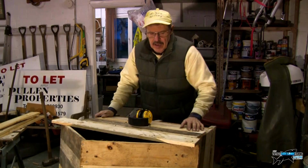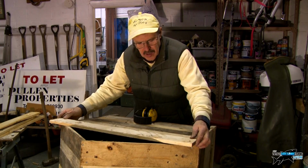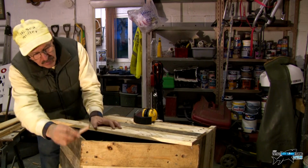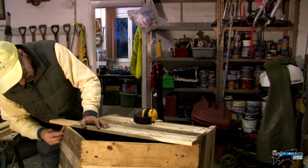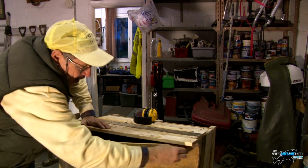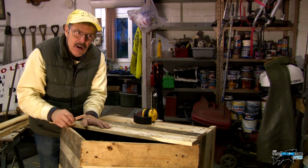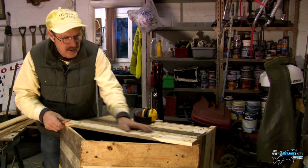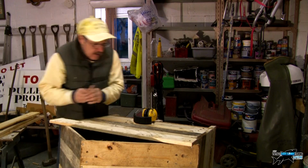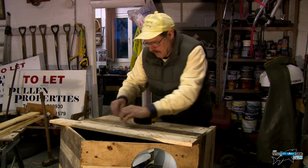Okay, so I tipped the kennel up on its end. I've just got to do this end gable at the back first. All I'm going to do is leave it on the outside because the felt I'm going to put on the roof is going to overlap here. I'm just going to get a board and mark it like this, either side. Do them one at a time and butt them up. Don't just cut what you think is the right size. Invariably, they probably won't be. So I'll mark the angles down there, like that, and then we'll cut the rest off with a jigsaw.